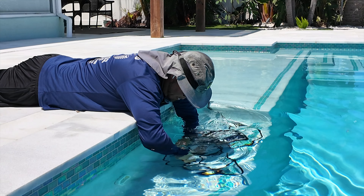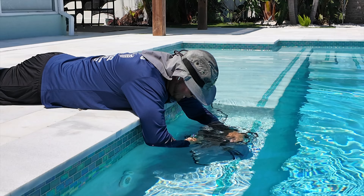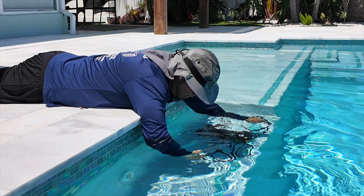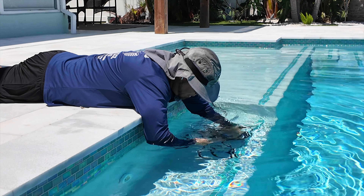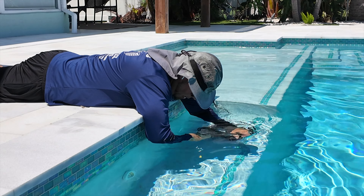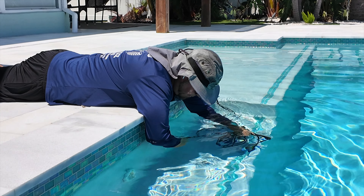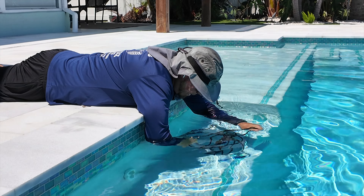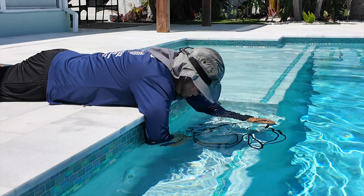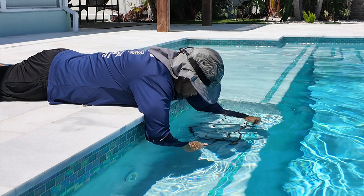Eric's thankfully helping and now I am going back to tugging. You can see it's getting clumped up as he's pulling more — this is why it's always helpful to have a second person doing a light. A quick tip: to eliminate pushing rotational torque on the SO cable and the wires inside, as you get closer to getting this put in, start rotating it to the left since we're doing righty-tighty. That way as we tighten it to the right we're limiting the rotational torque we're putting on the lighting SO cable and wires inside to help protect it.